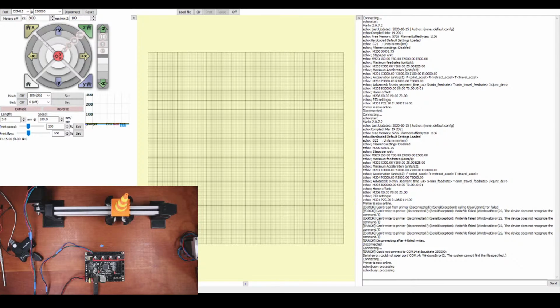So let me go to the chat and see what's going on. So I think we got it functional. You said something about Stealth Chop. Obviously I probably don't have the same steppers, so that might be a difference. It might be causing more noise, but I can order a new stepper for 0.9 degree step and try it out and see what happens. But let me go over and see what you got here. You got Spread Cycle, and then you have Stealth Chop. Let's see if we can change that. Yeah, it may be specific to 0.9 degree step.